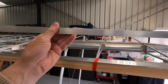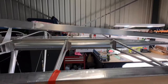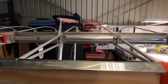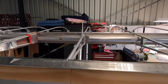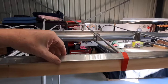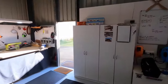All right, so last night, once again at knockoff, I riveted this piece on, then I realized I hadn't trimmed the end to make them all sort of flush. So I've quickly popped the rivets off. We'll do that again. That's knockoff-itis, I guess, kicking in. I've also got the tails now in these ribs, which will rattle. So I need to just, hopefully if I flex it up, they'll fall out. If not, pull the aileron off, get the rivet tails out.